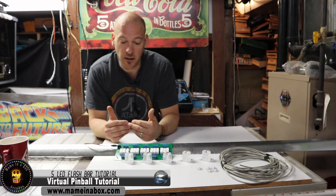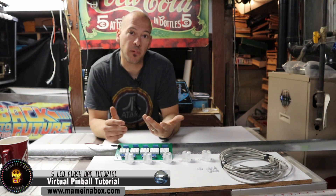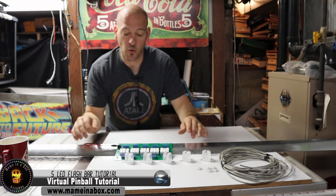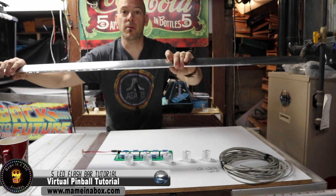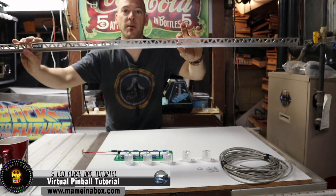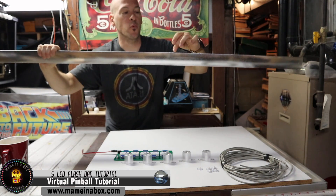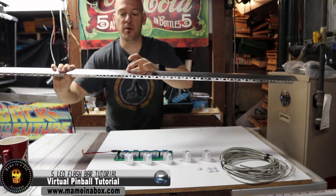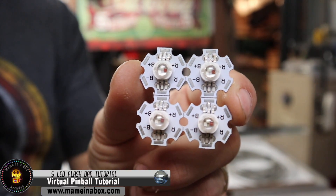For this particular build, I knew what I wanted to achieve, so I visited my local hardware store looking for what would make a nice bar. What I got is a 3/8 aluminum stair nosing strip. It's a piece of aluminum that fits perfectly — that edge goes against the top, and then we have room to screw, fish all the wires behind, and then we drill holes for our lights. They're 3-volt RGB lights, and we're going to show you how to connect them.